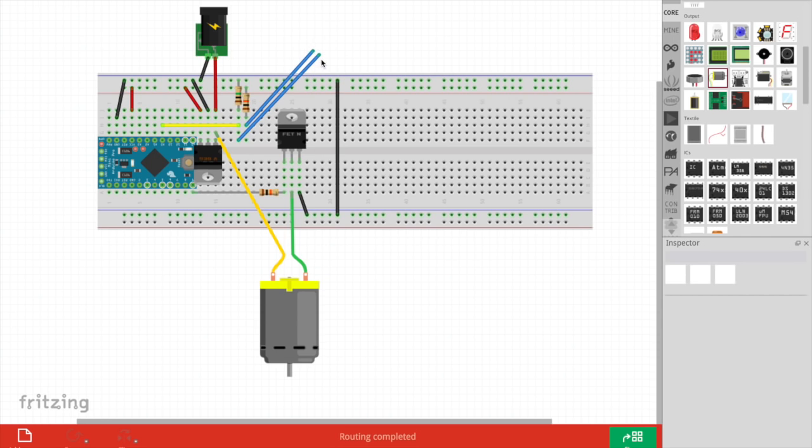Even soil with water in it would have far higher resistance than any normal electrical component. And this is just a current limiting resistor going into the top of the voltage divider. That will reduce the range of voltages that you're measuring across.